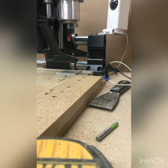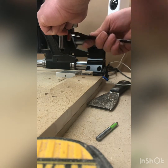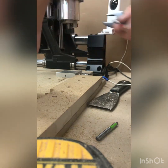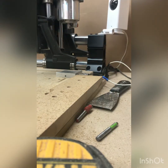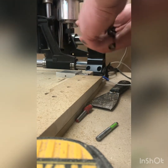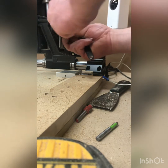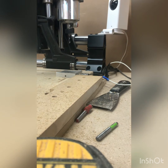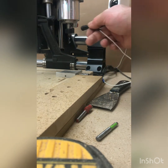Back over to the probe. Same pop-up as last time: Remove dust boot, change tool, attach probe, click continue. This time I've got the upcut spiral bit — I think this one's actually a three-flute. It's going from a shorter stickout to a longer stickout. Don't forget the magnet. We'll click continue once we put the magnet on.